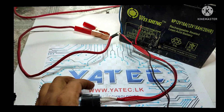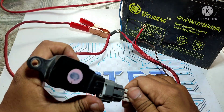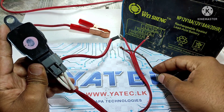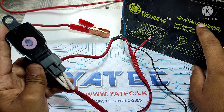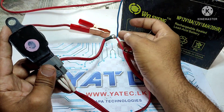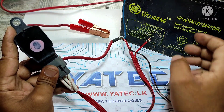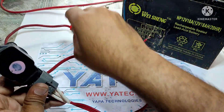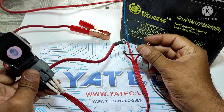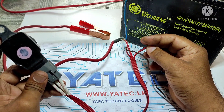First, I connect the female connector to the coil. I connect the right side pin to the battery plus voltage — the brown wire is coming from the battery plus pin. The center wire connects to the battery minus voltage pin. Then I connect this 2.2 kilohm resistor to the trigger wire. This resistor is very important to check this coil safely.